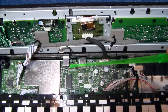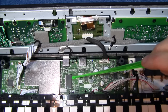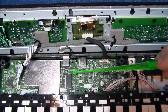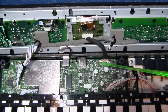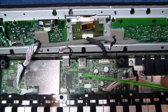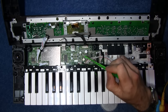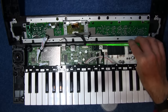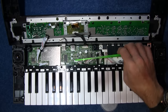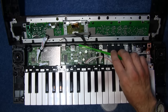Yeah, there's not a lot of difference in there. Like I say, there's a chip moved here. There's one memory module in here where there were two in the YC. So Yamaha have indeed got a different board, even though it's sort of 95% or even more the same as the YC's. The capacitors are also in a slightly different place, which means these boards have been respun for each model and things have been moved around to make space for the differences. So why couldn't they have moved a couple of bits and pieces around and put normal size MIDI connectors on this?